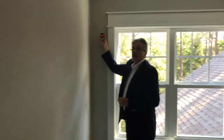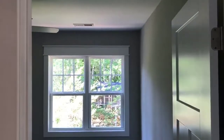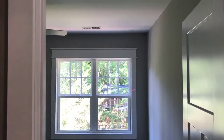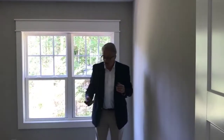What we're supposed to find when we do this is that this measurement should be about 1 foot less than the exterior measurement from the lower level. It really should be the same thing. It's a full measurement, but we took the exterior measurement on the lower level. And of course, I'm walking, so you can't take a measurement with the red dot doing all that. But you can see we took that full measurement, and adding the 5/10 of a foot for each exterior wall, it should match that measurement across the front porch of the front of the house.